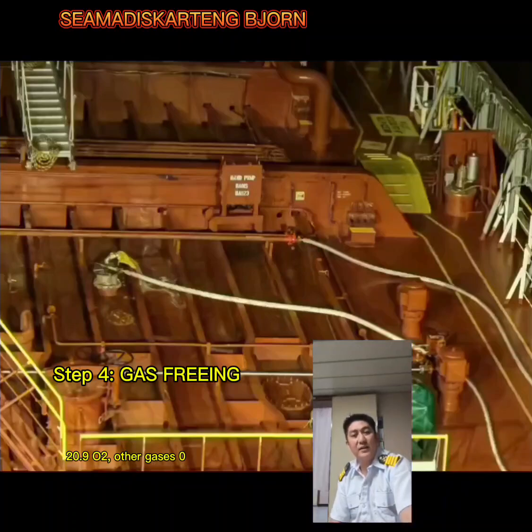holes, crack open tank lids, open the anchor wash, start the fire pump, and maintain pressure 8 to 9 bars in the main fire line. Check blower suction. So after completing the 3, 4, and 5 wings cargo oil tanks purging operation, you have to change over the gas freeing blower to 3, 4, 5 wings, 6 wings for gas freeing. So commence gas freeing using the IG blower in gas freeing mode, once the purging is completed.